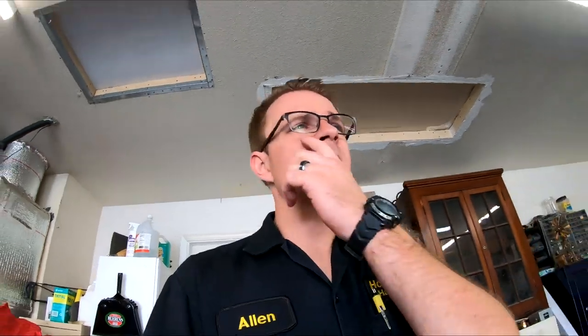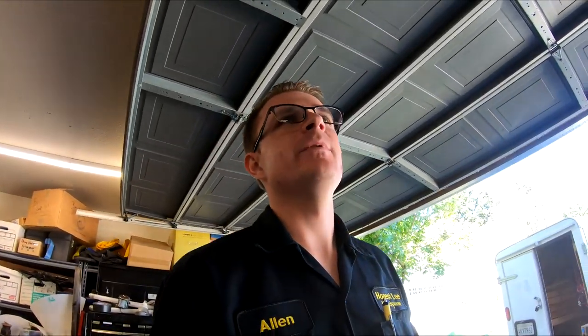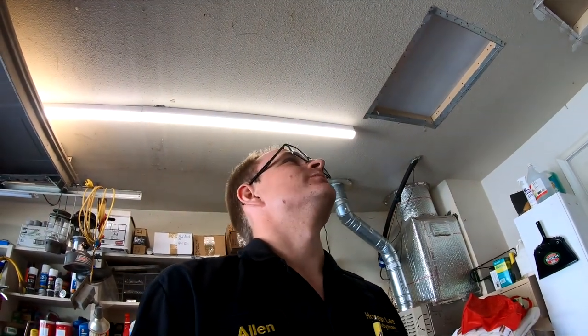What I found with texture is usually I do my first coat a really fine coat. So the first coat I do of texture is just fine, just leave it up there. And then the second coat I do the heavy setting on the texture can, and that usually sprays it pretty good. And sometimes you don't even need to knock it down. That's at least what I found.